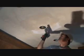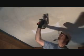And if I see a little bit of white coming through, I can put a little bit more on, you know, where it needs it. I can do that. And as I'm wiping, I'm going to push harder on the left hand on the bottom side and let the other side float just a little bit to get it where I want. Or you can do it in sequence. Put some right there first. Now on the edge, you want to get the edge off. Okay? And then I can just keep moving forward.